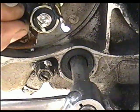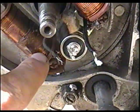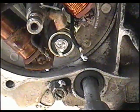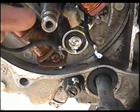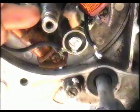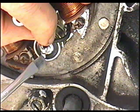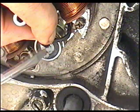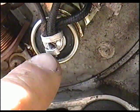You're going to have three wires that will be soldered to the condenser: one going out to the ignition coil, one coming from the primary coil, and a third wire that goes to the points. Tie all three together and just clamp them on the condenser. I've got all three wires clamped onto the condenser, making sure to keep a good distance between the wires and the outside of the condenser.